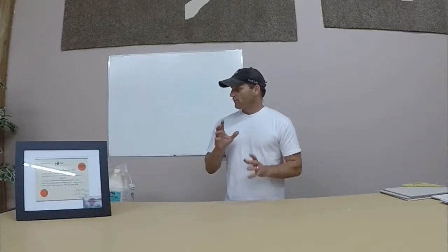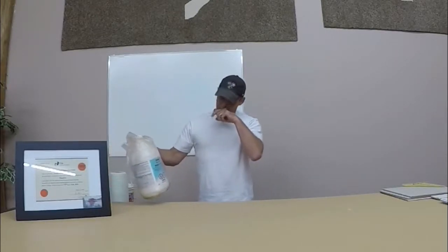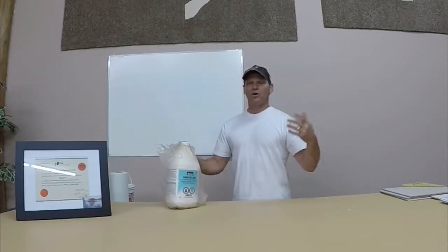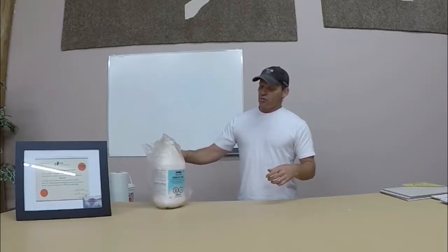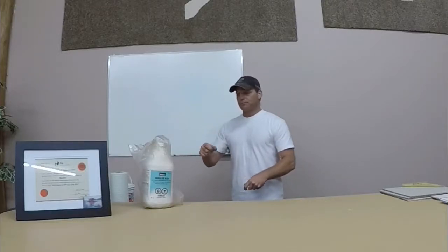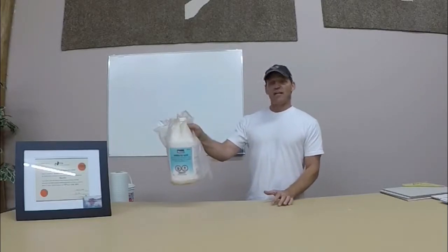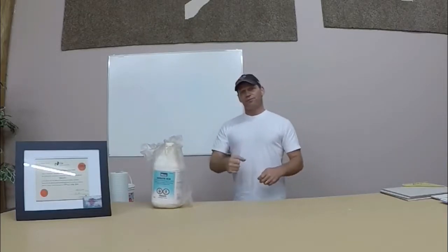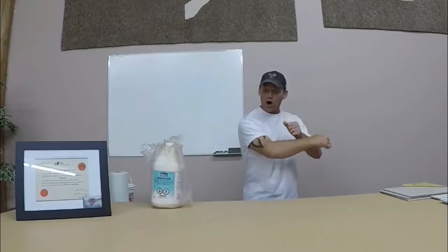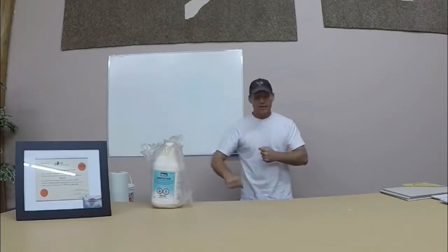If you need the floor to be clean — like if there's grease and oils on the floor, or the floor is just way too dirty — what I like to do is give it an acid wash. You can buy muriatic acid anywhere: Canadian Tire, Home Depot, Rona, Lowe's, whatever. It usually comes in a bag like this. You're going to need a commercial mop bucket and mop. Fill it up with water, put this in just enough, and when you're mopping the floor you don't want to wring the mop out — just stick the mop in the bucket, pull it out, and let the water go all over the floor.